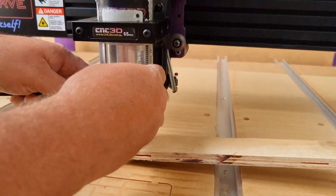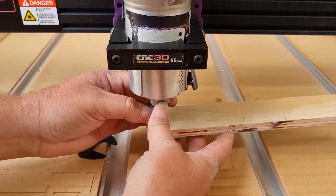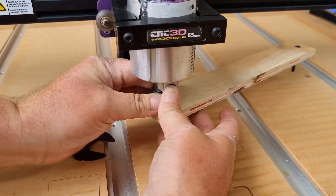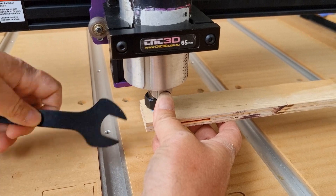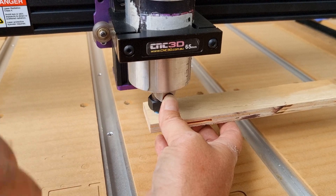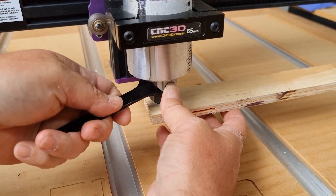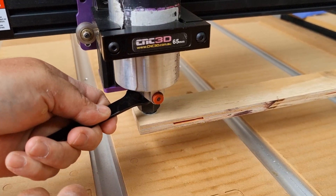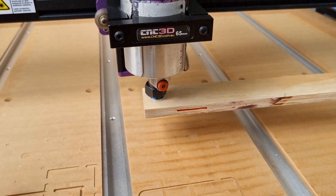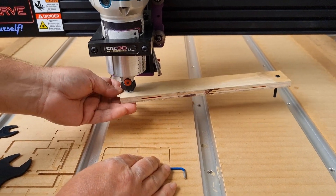First thing to do is loosen off the nut — it's already quite loose. We'll push in our little red button and get the bolt started, then once it gets a little tight we'll add a bit more pressure. It is recommended to use your small spanner rather than the little red button on the front, as it's not designed to have a lot of pressure on it. It doesn't need to be too tight — we just need to make sure our tramming tool is firmly secured without damaging the collet threads.